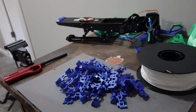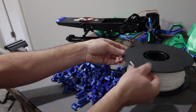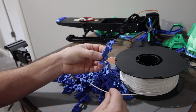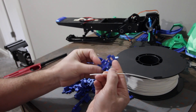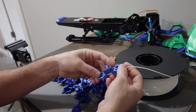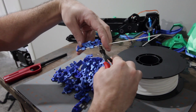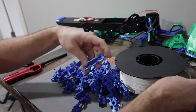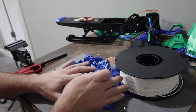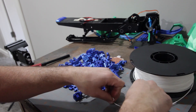Now we can put the track together and it's pretty simple. I'm just going to use some filament off of a roll I've got laying around. Grab a piece of track and your filament, and where this tab is you'll feed that through. Make sure it goes all the way through and seats into the bottom, then take some cutters and cut that off right flush. That'll give you the length you need your pin to be. You can then use that to cut yourself a whole bunch of these little pins.